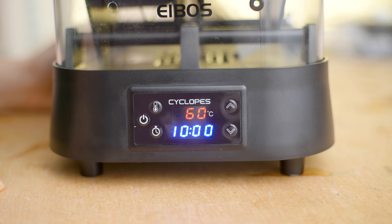Another thing I liked was that it can fit two spools, which is nice because while the dryer is running and using energy, I can put in another roll and get that dried for a future print. Especially with the vacuum pump system — I can dry a spool while one is actually being printed and then store it away in the vacuum bags. The last pro is that it holds its temperature quite well. I used an Arduino and a temperature sensor to record the temperature independently — it took about 30 minutes to bring it from room temperature to 63°C, then slowly climbed to 64°C and held that for a two hour duration. I had it set at 65°C, so I would say that is good enough.